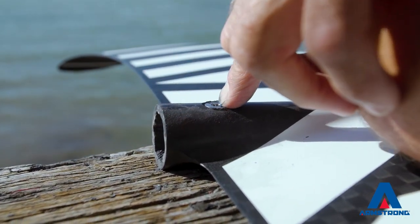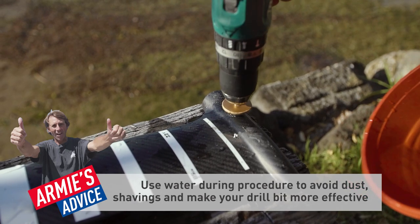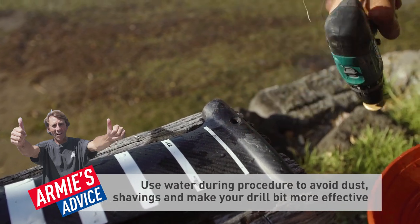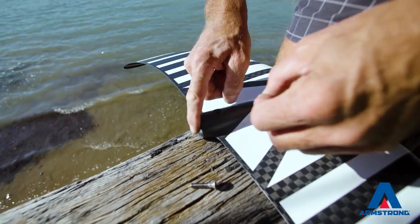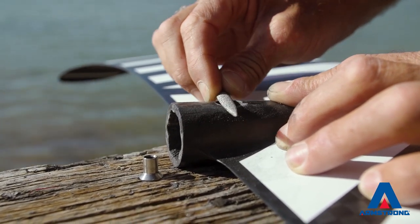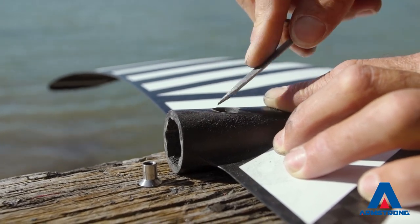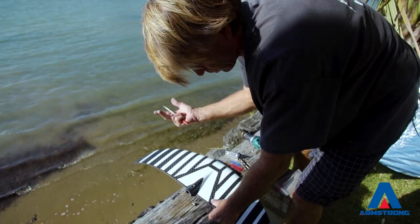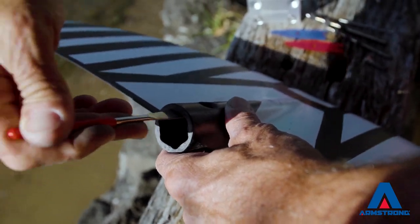Check your titanium barrel nut in the hole. What you're checking for is front to back — it should be flush front to back. The sides are going to be a fraction proud; that is actually normal. The front and back is what you want flush. Check the screw — feels good front and back. Now clean up those edges and the inside with the file. Get your little diamond file from the kit and buff the edges carefully the whole way around, then file the inside of the hole to clean up that flat.